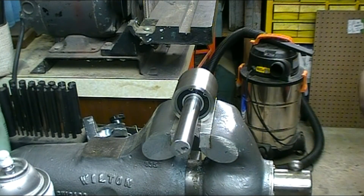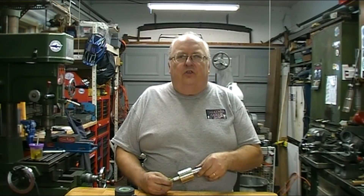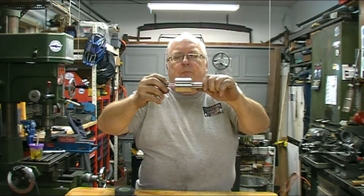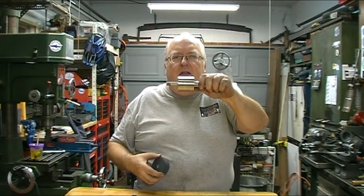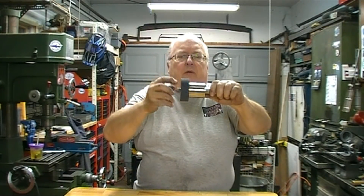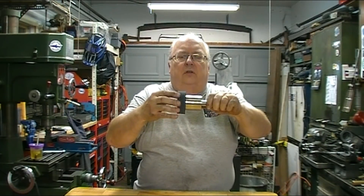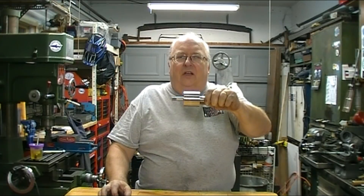When we come back I'll put the grinding wheel on and we'll give this a try. That wraps up the Diamond Grinding Wheel Crush Dresser build. Here's the assembled part — it is beautiful, nice and smooth, seems to turn concentric. The Loctite is still setting. The wheel mounts on here and I have a nut; I'll put a flat washer — I have half inch washers already made up for this. The other thing I've got to do before I put the wheel on is make a paper disc for it to crush against the wheel. So that's a wrap, see you in the next video.